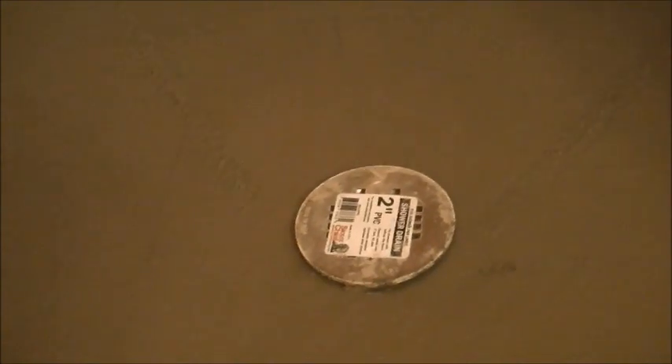After about 15 to 20 minutes of manipulating all the mortar where I need it, I had a little excess causing some issues — I would be level in some areas but not others. Now I have it down pat. The front part bubbles right on, left side bubble is right on, right side bubble is right on. When I say right on, I mean the level should be flat to the ground with no dips or humps, though humps really don't matter — you can scrape them off the next day with a blade. You should be level on all four sides.